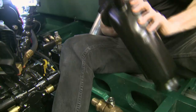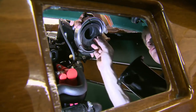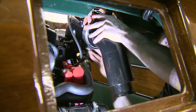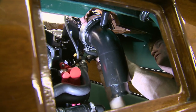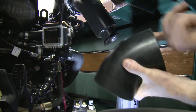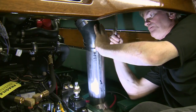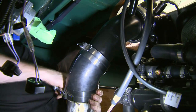The next task was to install the long-awaited curved exhaust tailpipes. These special curved units were the first shipped by Mercury, making this engine install possible. The dual flanges and special clamp band allow the tailpipes to be rotated for exact positioning. After applying Vaseline to the inside of the rubber exhaust joints, they were slid onto the tailpipe on the engine, and the stainless steel exhaust and all connections on both sides were double clamped.